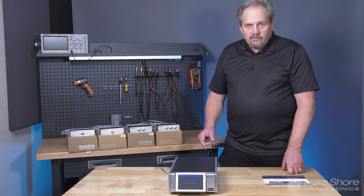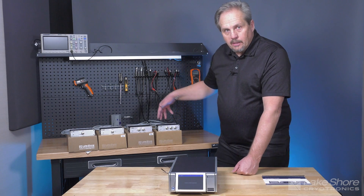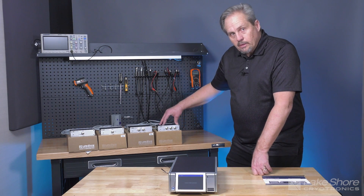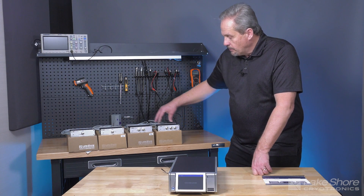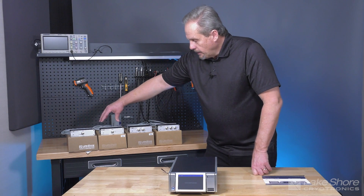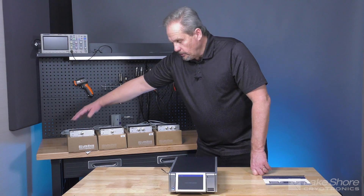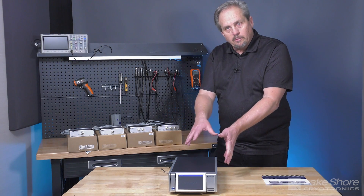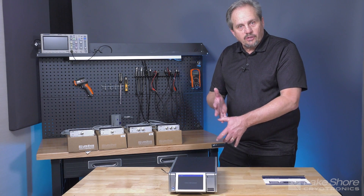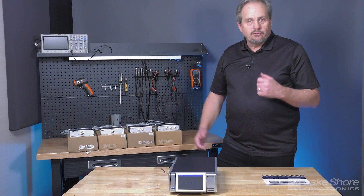The M81 system is comprised of the control instrument and four modules: a differential or balanced current source module, a single or differential voltage measurement module, a single-ended current measurement module, and a single-ended voltage source module. These four modules combined with the mainframe support up to three source and measure channels simultaneously, synchronized for an all-in-one complete source and measure solution.